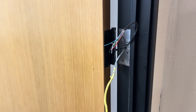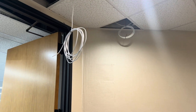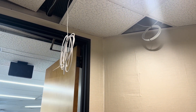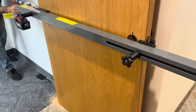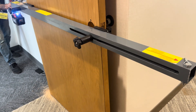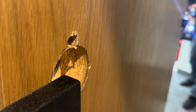For those card readers to be able to unlock the door, we hired a locksmith to help us electrify the door. We don't like to use door strikes because in a multi-tenant space, you actually need to cut into the frame. And most of your leases, when they're over, force you to repair that damage. If you just electrify the lock and take away the power when you move out, then the keys still work, and the landlord is happy.